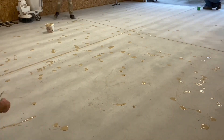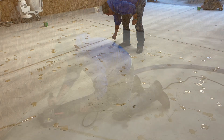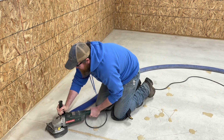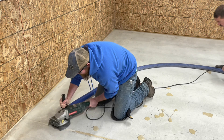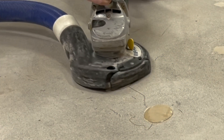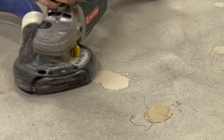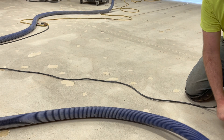Smith's Poly JF is a heavy duty, self-leveling, moisture tolerant, two-component, semi-rigid polyurethane joint filler. It's used to protect joint edges as well as to fill in gaps for spalling. One of the many benefits of this Smith Poly JF is it can be shaved in roughly 90 minutes, and it can be diamond ground in just a few hours.